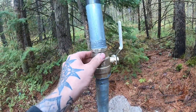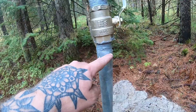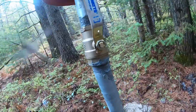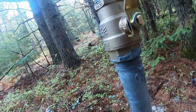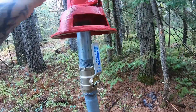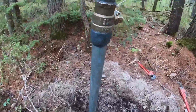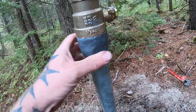The next section went on but it's very crooked — I don't know how well it's going to seal. I put a lot of pipe dope on there but it might not work. These mosquitoes are insane. I put the well pump on and that's a fail — it's pulling in air right here and really leaking. If I seal it with my hand it actually comes out. I put a bunch of putty on there — kind of a temporary fix, I don't expect it to last long. Let's see how it works.